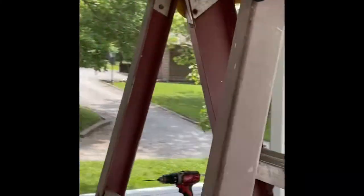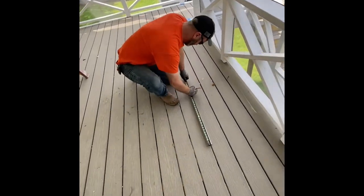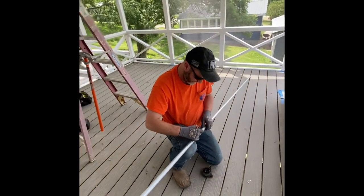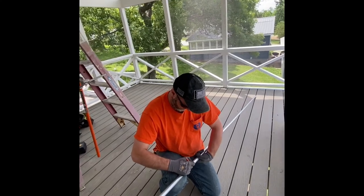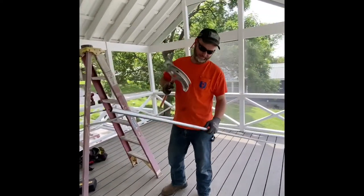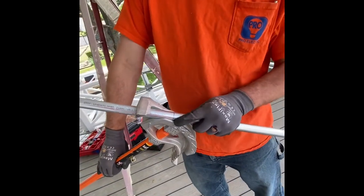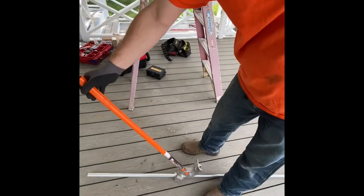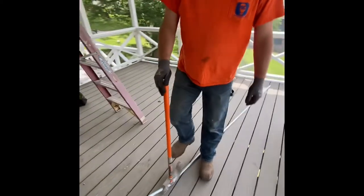I'm going to come over to my conduit and mark out 27 inches. When doing conduit it's always good to mark in pencil because it's easier to erase. You could use lipstick, but it's going to leave an oily stain — it is more weatherproof though. So now that 27-inch mark is on the conduit, I'll put my bender on that pencil mark — that should be center. A trick of the trade: for 30 degrees, when your handle is straight up and down, that should be a 30 degree.